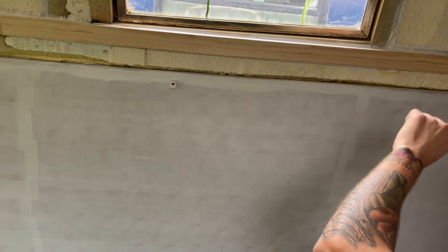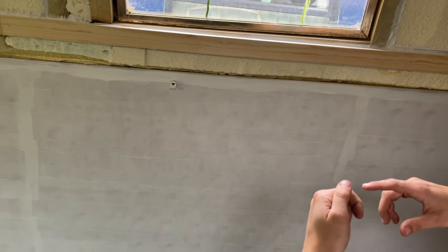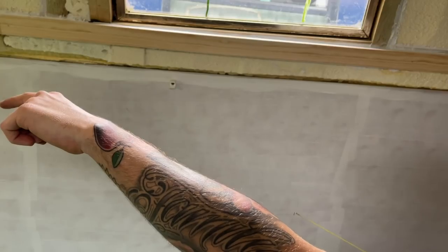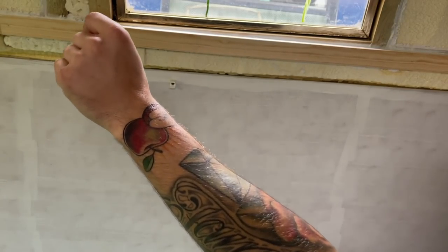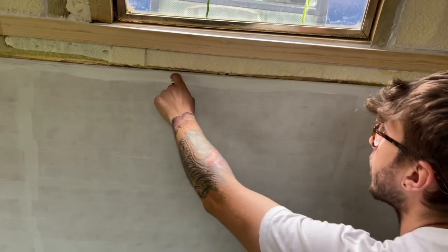Yeah, because what we need to figure out is you're getting a cold, basically it comes from the water tank, pumped to hot, pumped, and then you want a cold to come off here, the cold tap in the bathroom and cold for the shower bath, and then a cold continues then to work its way down. You want a cold on the kitchen, and then you also want a cold to go into the hot water heater, but then pumps back, so you need to do two runs of pipes. I reckon the cable's gonna have to be mounted up here, so we're gonna have to do two rows of these because you have to have a cold coming back, a hot coming back. Do you see what I mean?